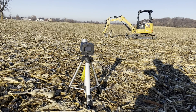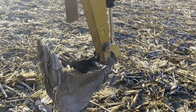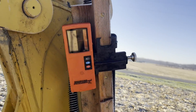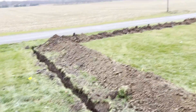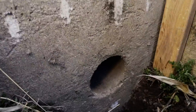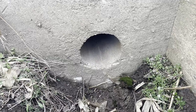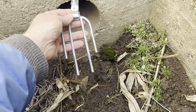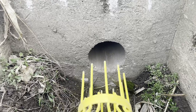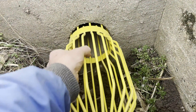I've got a spinning laser level set up here and the sensor on the stick of my excavator that beeps when right on. Our perimeter drain is all dug out all the way around and ends up in this concrete box. We want a critter guard to keep animals out of our drain pipe — normally they bolt into a plastic pipe, but instead we're going to use this trash cage to get the job done.